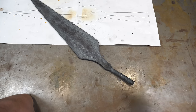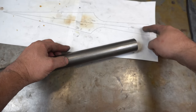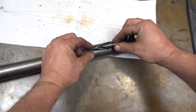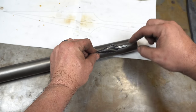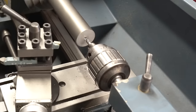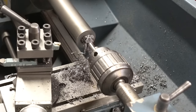The socket is going to be a piece of inch-and-a-half 1045 steel. I'm going to cut a section off and do the cone socket in the lathe. I'll drill all the way through to create a channel about 5 inches long, then use a boring bar to widen it so it's cone-shaped through there. Then we'll taper it on the outside and cut a slot so we can forge weld it. While this may look quick in the video, this was a better part of 2 hours to get done.